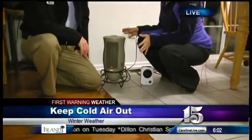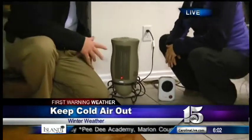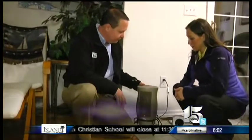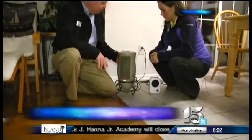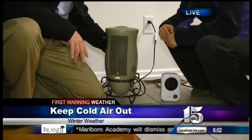Good morning. That's right. Talking about space heaters, I've had to use this so far. Our heat went out. We talked about that earlier, but there are a lot of things that can go bad when you use space heaters. So walk me through some safety tips here. Well, basically, as far as child safety, you want to choose the right heater and have it positioned in the right area, away from furniture and any kind of walls. Have the settings right. Make sure it's on auto. It does have auto shut off, and you can keep the back vacuumed out, keep the debris out of it so it doesn't get to the heat strips.